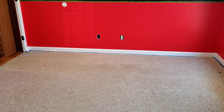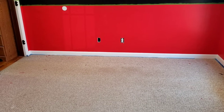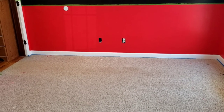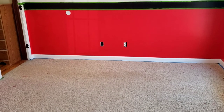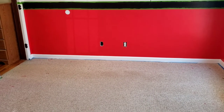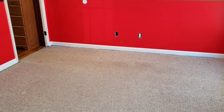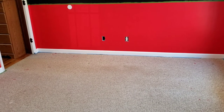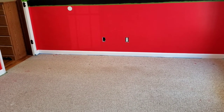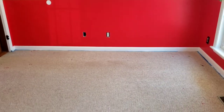If you leave the new carpet face up, then you will need to use the old carpet pattern face up. If you do one face down and one face up, it's not going to work. So remember, the new carpet is going to go face down, and then take the old piece of carpet and lay it face down on the back of it, because it's easier to cut from the backing side.